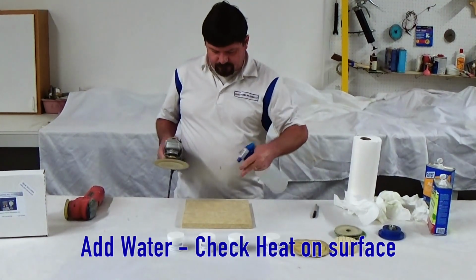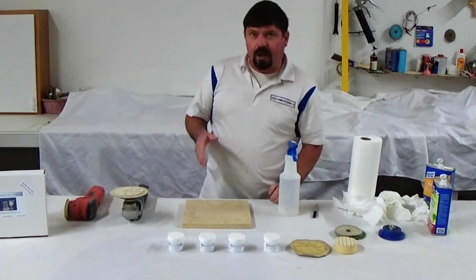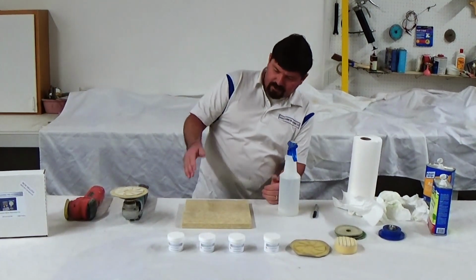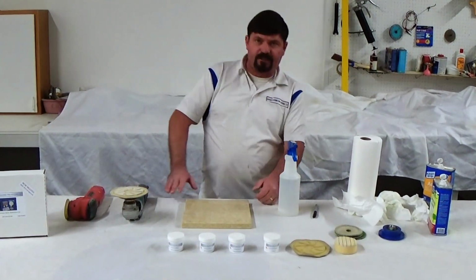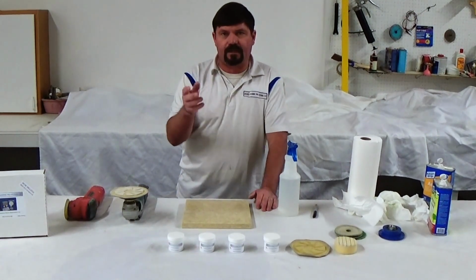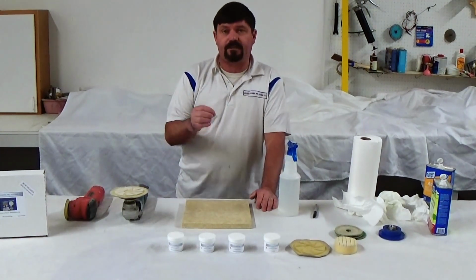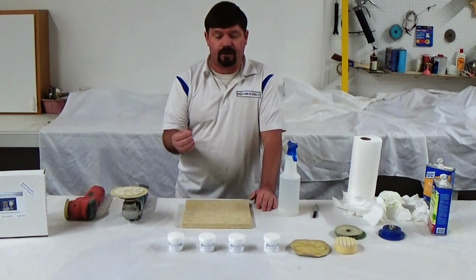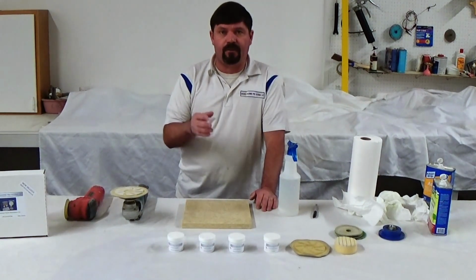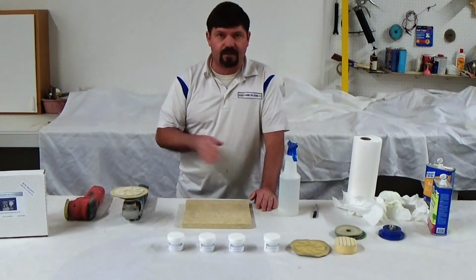Very warm. So as I'm polishing the surface of the material, I'm drawing the light through it, and I'm looking for a very consistent finish. If I have any place that looks like a fog, looks slightly gray, anything like that, well then I simply want to focus more on that, because what that's telling you is that your aggregate, quartz in this case, is not polished up to the factory polish yet. So we want to keep going until all that fog is gone.